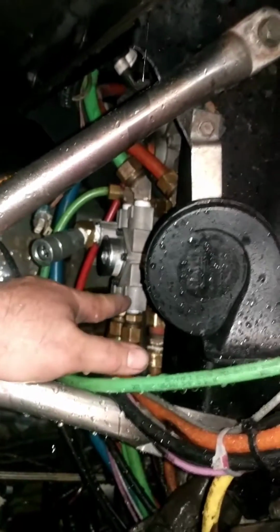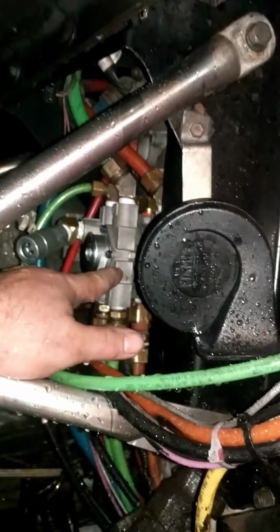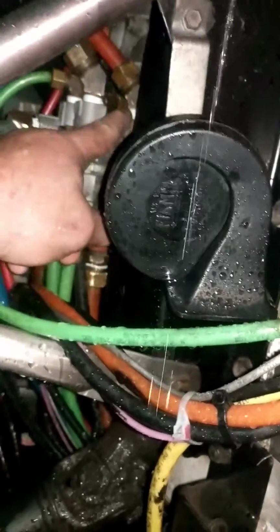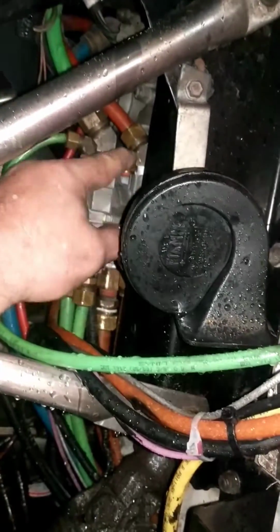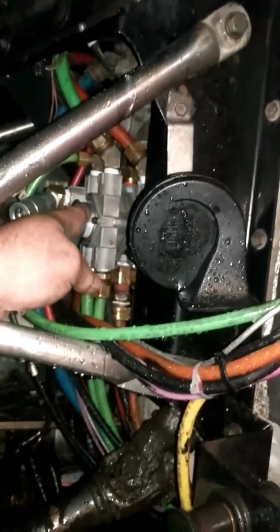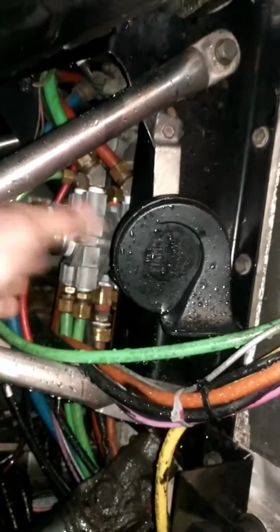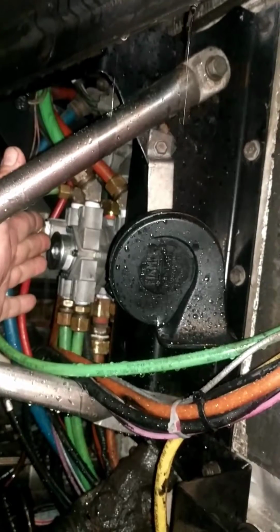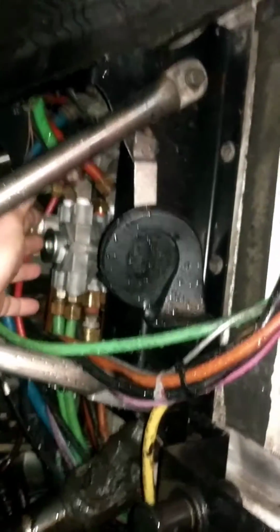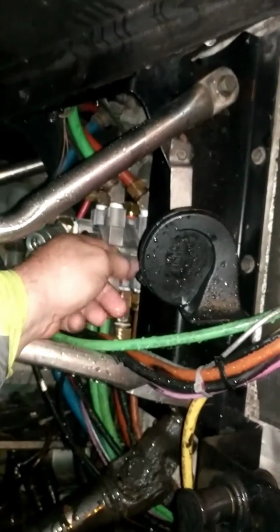So anyways, another thing I would do is I stuck this in my vise, put all the fittings on it, snug them up really tight, but I also took a picture before I tore the old unit out to see exactly where all the air hoses went. Those back hoses right over here, excuse me, on the bottom and on the top, super difficult to get at. If you mount the unit first and then try to do all the hose connections while it's mounted to the firewall, you'll make a huge mistake. So what I did was I kept it loose. Obviously I didn't secure it, mounted all the air hoses, tightening them up pretty good, and then I went ahead and had my friend thread the bolts while I held it to the firewall. That's the only help you're going to need on this whole entire install, is to have somebody hold this, or you hold this while somebody goes in the cab by the pedals and mounts the 3 bolts.